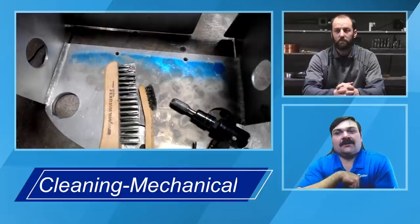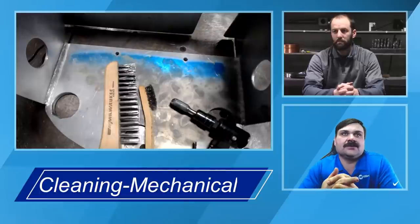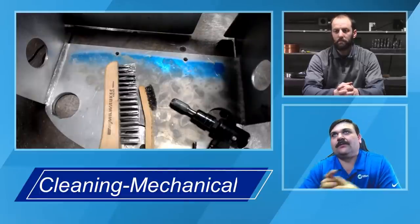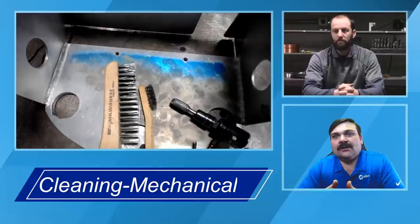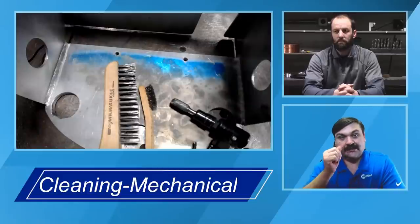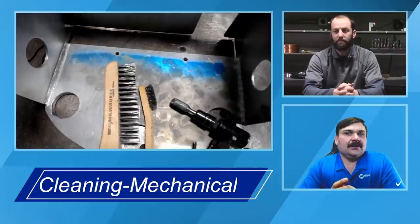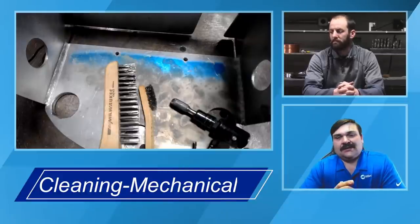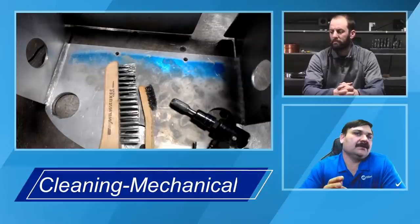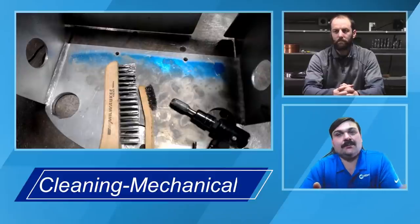You guys will notice we spent the bulk of our time tonight talking about cleaning aluminum. We're going to spend a little bit more time here talking about edge prep and joint geometry in the few minutes that we have left. But the reason why we spend so much time talking about cleaning aluminum, from my perspective, is it's the number one thing that makes a huge difference in setting you up for success, whether you're a beginner or in a fab shop and you need high quality. Aluminum is extremely picky to contamination. You're going to see that in your welds and travel direction when we get into MIG welding and stuff like that. And it's surface contamination. All of that plays a huge role in how successful you're going to be in your end result. So that's why we spend so much time here today talking about cleaning it, because it is that important.